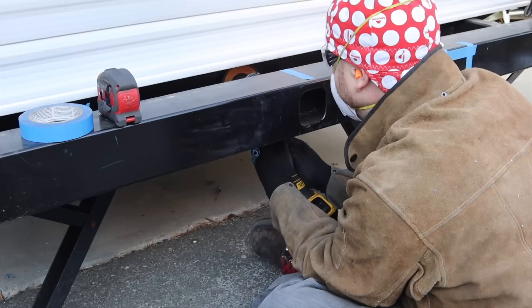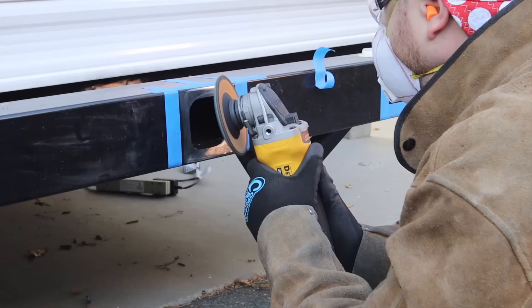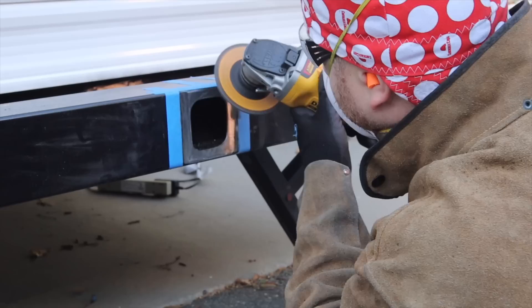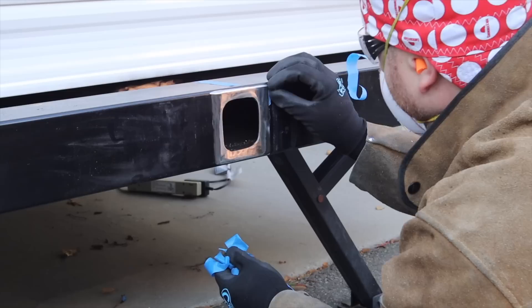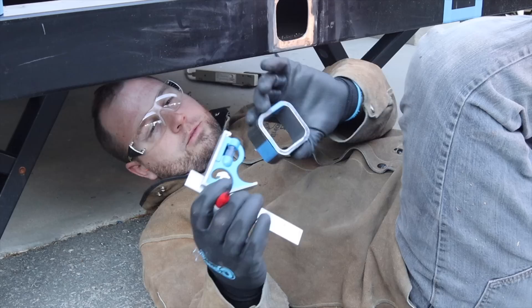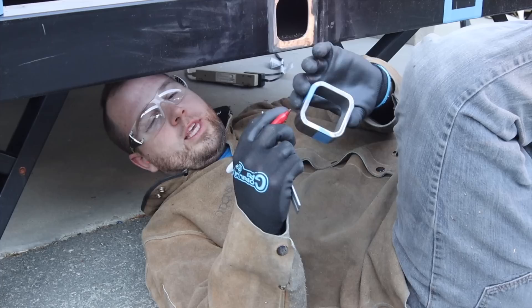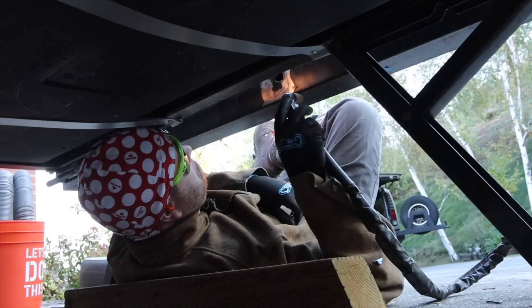I'm keeping this lens away from those sparks. We put some tape on here and use that as a template. We get relatively straight grind lines so when we paint back over it won't be a big weird-looking mess — we'll have some pretty crisp edges. We're going to scribe — marker, sorry — the inside of this tube with the outside diameter, positioning it absolutely perfect, and then plasma cut out the back side. Then we're ready to weld.